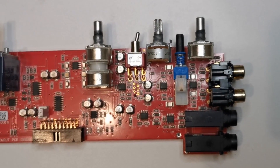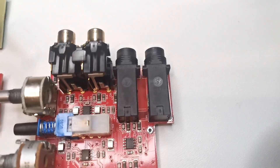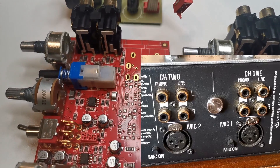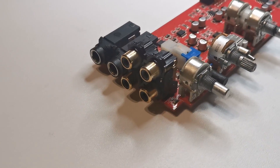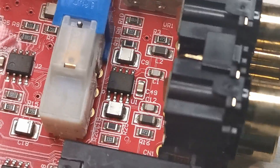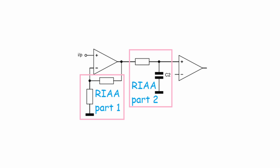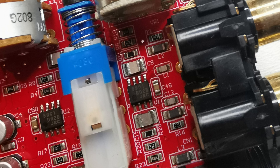There are two variants of these boards: one variant has a mic input, the second variant includes booth or AUX outputs. Taking a look at the rear panel can help you imagine how it's done. Every channel board has gold-plated RCA connectors for phono and line inputs. The phono preamp is a two-stage active-passive solution — rarely seen in other mixers, but this concept was used in the classic Urei 1620. The idea is to split the gain into two stages and treat one part of the RIAA EQ using an active circuit and the second part using a passive filter. Splitting the gain can lead to lower distortion.